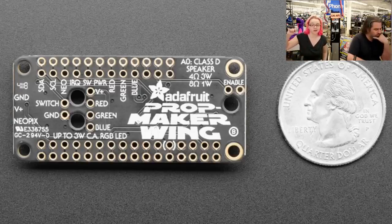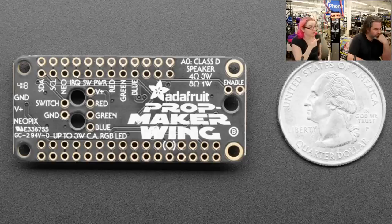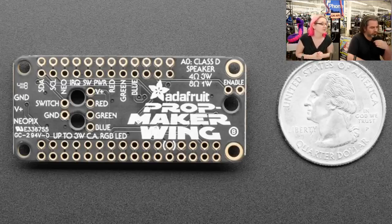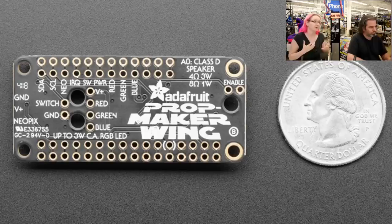The extra cost for a 9DOF sensor doesn't usually pay out because a lot of people don't have code that can really read 9DOF data and do something complicated with it. For a lot of props you just want tilt, motion, 'I shook it,' or 'I hit it' — for those things the accelerometer is plenty. Like with the lightsaber, you don't need a gyro or magnetometer to do the swing or hit. Also, Phil B had a great project showing how the accelerometer can detect steps — so a person in a dragon costume would make stompy sounds when walking and a roaring sound when they jump. The LIS3DH is low-cost but a really great accelerometer and we have tons of good support code for it.